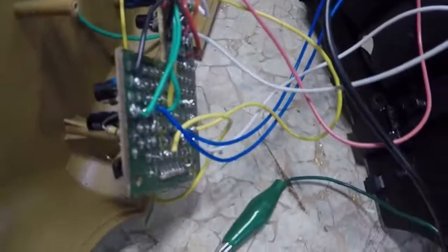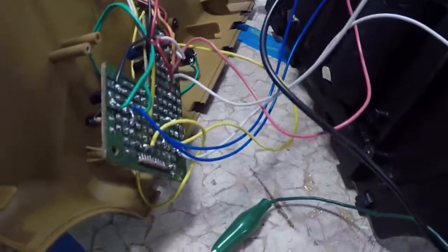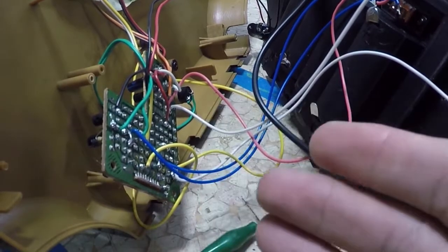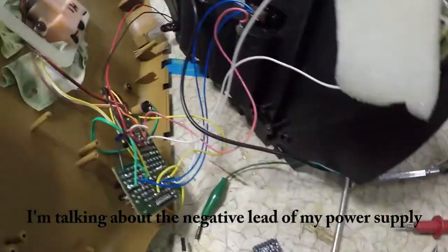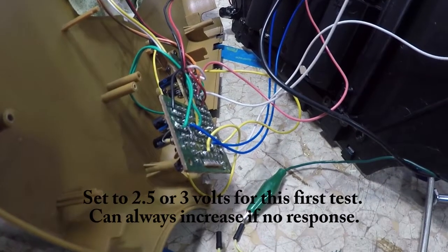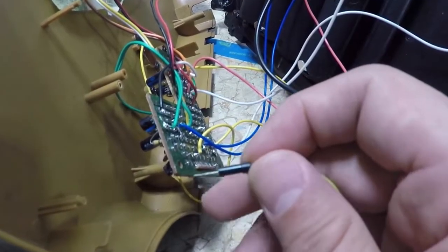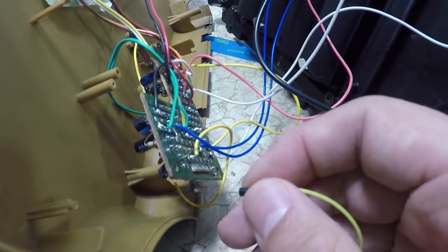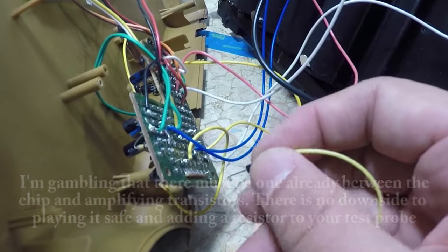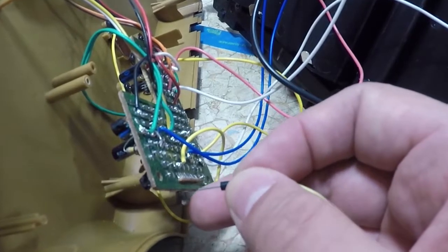All those transistors are just amplifiers for the motors and speakers. I found this little chip that connects to a header that just outputs a signal - one for the audio and one for each motor. I've connected the negative lead to the negative from the batteries and have three volts coming right here, figuring that was about what comes off this microcontroller. Ordinarily I'd be worried about a current limiting resistor so I don't blow the amplifier chip, but there's already one on this board somewhere.